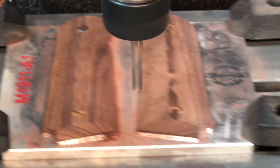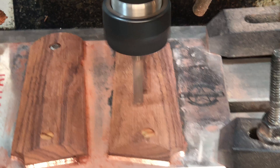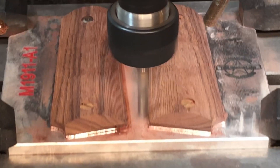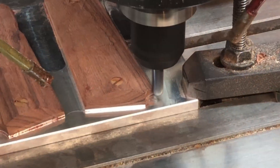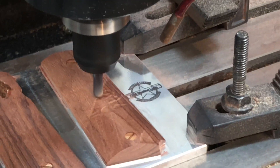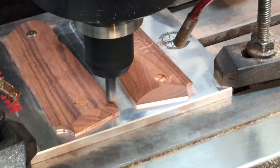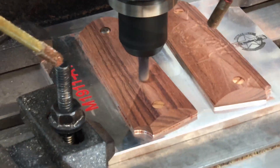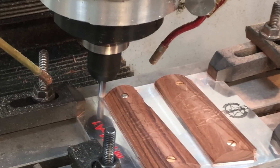That last bit of material remaining on the right side of the grip is a little too tall — this winds up kicking me in the stern section, I'll show you in a little while. In order to remove those little steps, I'm using a ball end mill cutter running about 45 degrees from the steps — I find this leaves a great surface finish. Every time the cutter moves over into the work it's moving five thousandths of an inch — the stepover. Five thousandths might be a little excessive, but wow, did it give a great surface finish. There was almost no sanding.